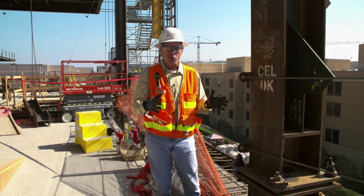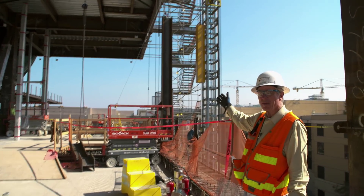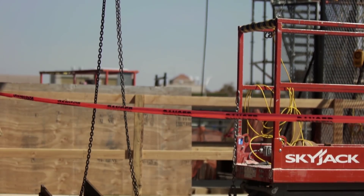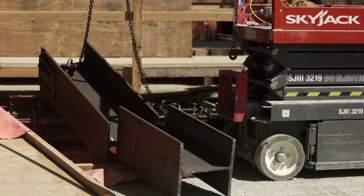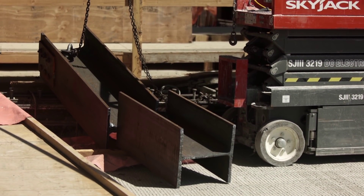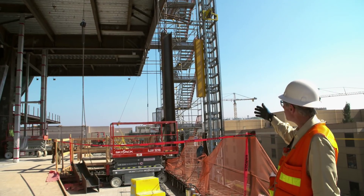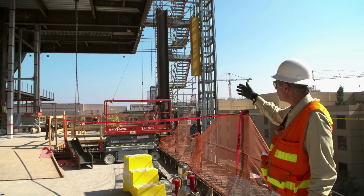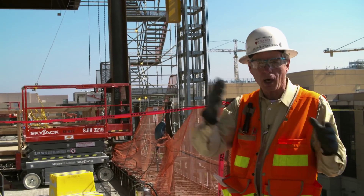The way they've been doing that — you can see behind me there's a column that they've actually taken the top, probably six feet of that column off. They've lowered that down; it's on the left side over here. You can see the chain fall that's got it in place, and then you're going to lift that column up, pull it out of the way, lower it down, and move that operation up to this one.